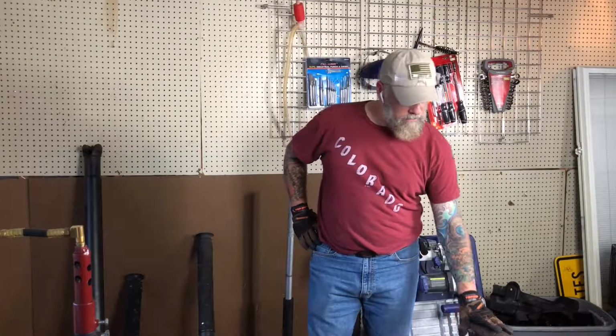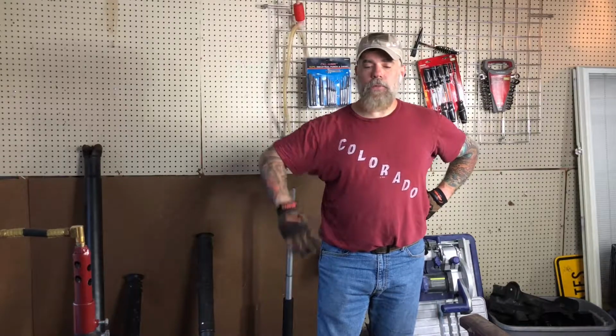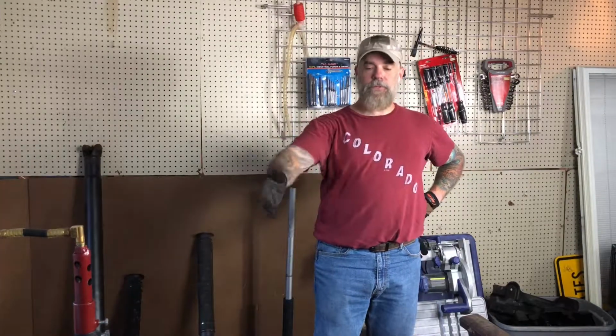It's difficult. I cut off too big a piece. At first it's difficult to get that in the forge, and then with my railroad track, it's kind of hard to straighten out. So eventually, I got this section, and that's still kind of hot. I got that section straightened out, so I just got the grinder back out and cut it off, and then started working with that. The goal again was to see if I could forge weld at a lower temperature and to see if this could get there. And I don't think it did. But again, there's so many different things involved in doing this that I have no idea.